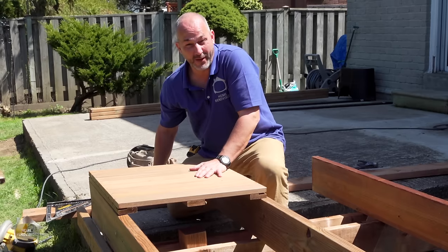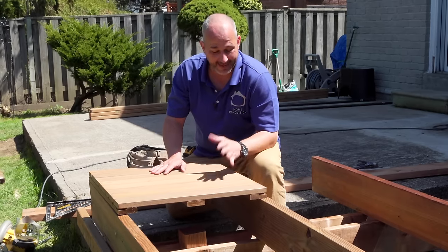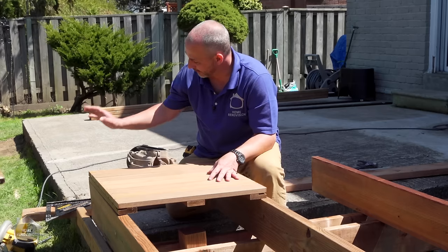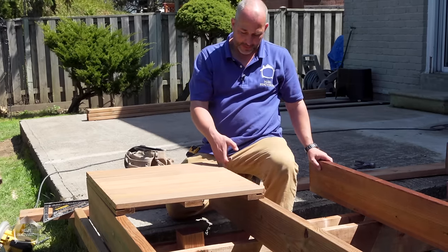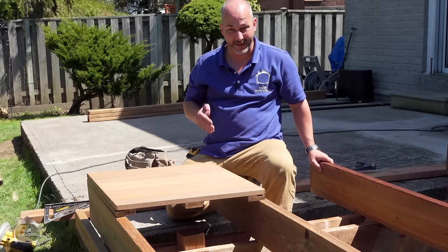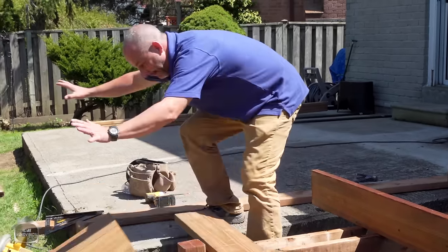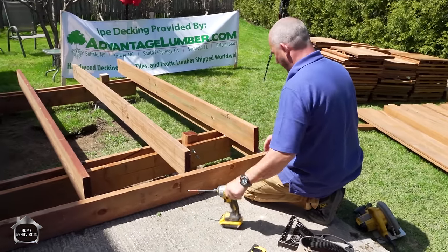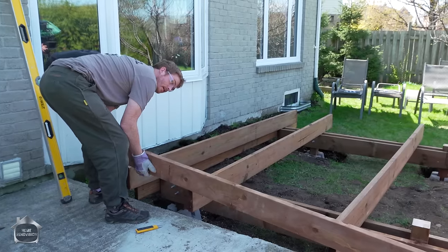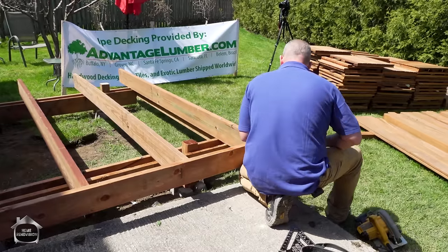Our ridge is 12 feet and 3/8. It's a little long from the factory, and we are going to have exactly 12 feet of finished decking. So I'm going to just trim this down and I'm going to install it on this edge to get started. We'll put every one of these joists attached at 24 inch on center from the outside. And then let's put the deck together. We're going to get you to help hold that up flush with the top of that board over there. Okay, ready? So when I'm screwing this together, I get a good result.